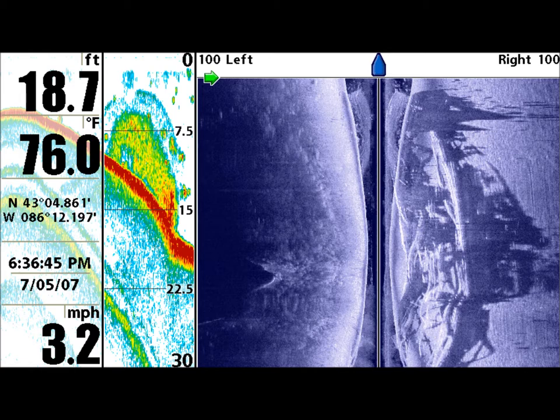It's kind of like if you went through a darkened room with a flashlight and just shone the flashlight, turning with your body — you'd see whatever was in that room, whether it was the wall and then something in front of the wall. That's essentially what a high-speed side imaging unit is doing: shining that beam all across from the side all the way down to the bottom. Things that beam shines on cast shadows, just like a flashlight beam.